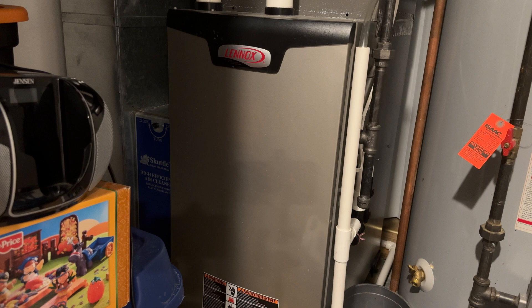With the furnace on full blast, the furnace kind of acts like an 80-plus or 90-plus regular style furnace where it just ramps up and ramps down — except it doesn't do that on a normal basis because it never needs to ramp up this much. I like to ramp it up to full power at least once a year just to burn off all the unburnt dust that it doesn't burn off when it doesn't run at 100%. I tried to do it earlier this year but didn't have the time, so I'm doing it now after New Year's.